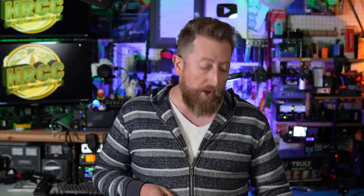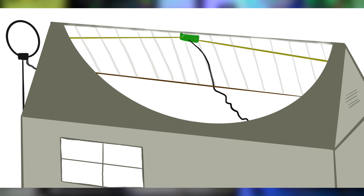So a couple of things up front — and this is also for everybody that sends me emails: make sure you give me all the details. The vertical height is obviously important, but I also need to know the horizontal length. Horizontal length is basically what's going to tell us how much of a dipole we can cram into an attic. An attic is a compromised location to put up an antenna, but it's generally in your control and completely invisible to those around you, particularly those in your HOA. I would recommend building a dipole for the longest band you can fit in that space. Hopefully 20 meters will fit — that means 14 to 16 feet on each side of the dipole center connector.